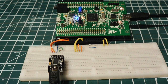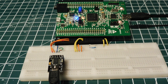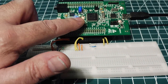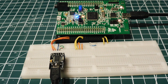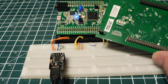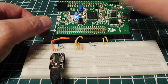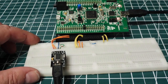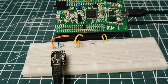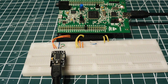My program is up and running on the discovery board — the four user LEDs are on, confirming the program uploaded through USART3 via the serial flash loader is working. Hitting the reset button repeatedly shows it boots my program each time. To enter boot load mode, we put a jumper on Boot Zero to pull it high to VDD. On the back of the discovery board there are two spare jumpers we can use. When we jumper Boot Zero to VDD and hit reset, the LEDs don't come on — it's in boot load mode, looking for the serial port on USART3.